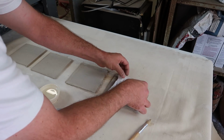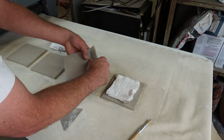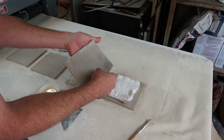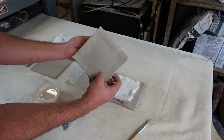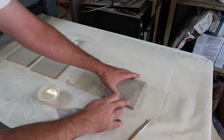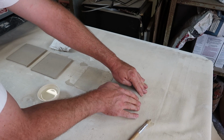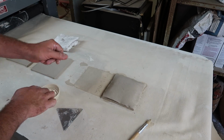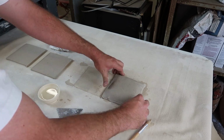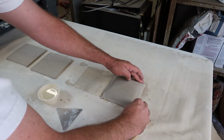So as you can see, I have some cone 13 refractory clay. It's intended for making kiln furniture, and I'm going to use it. We're going to start out with doing some test tiles for insulation tests, but I want to use it to make a knife forge. So hopefully we're going to get away with using a ceramic sponge, but we won't know for sure until we do some tests, and then we'll get to assembling the body of a ceramic clay mini forge. So I hope you enjoy, and let's get to it.